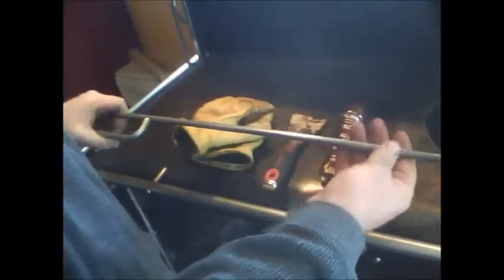The tools I need: one of these to lift the stove plates up, a gasket cleaner I use from auto mechanics to get way back in there and scrub the creosote off, a flashlight, and a spatula. I also have the tool that came with the wood cook stove from the manufacturer to reach way back and scrub certain places. I use gloves to keep my hands clean, and a wet-dry vac to collect the finer creosote particles we break away instead of hand-picking each piece.